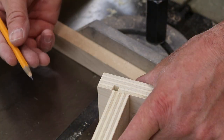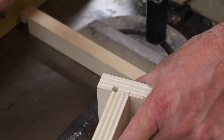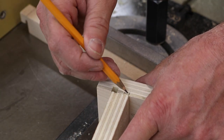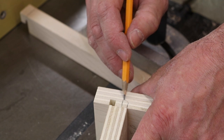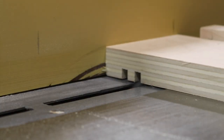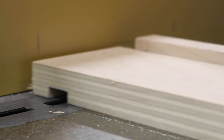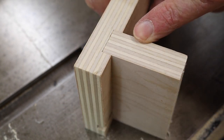I'm using three-quarter-inch plywood for the drawer backs. I'll mark a line here and then slowly move the fence over and sneak up on that line. Once I've got a nice tight fit on the test piece — basically this is your important cut — I'll make this cut on all of the drawer sides and then plow out the middle piece. And that looks nice and snug, so next I'll make the dado cut on all of the sides.